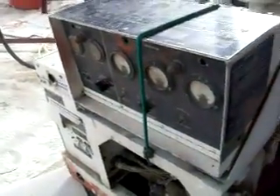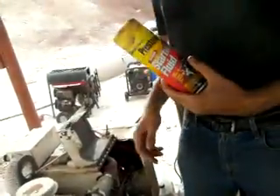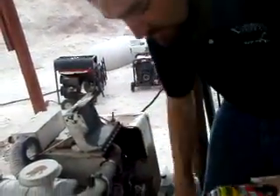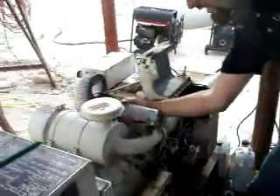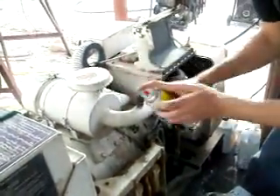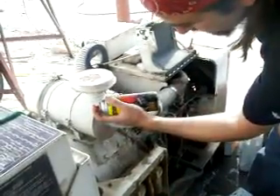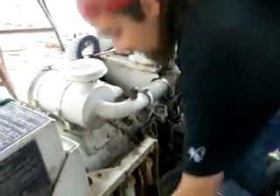Before I do that — if Casper will not start, it is possible that you need to use some starting fluid. Starting fluid can be applied by shaking the container and spraying it up into this mushroom-shaped nozzle right here, right up into the bottom like that. Two or three squirts of starting fluid in there should be enough.